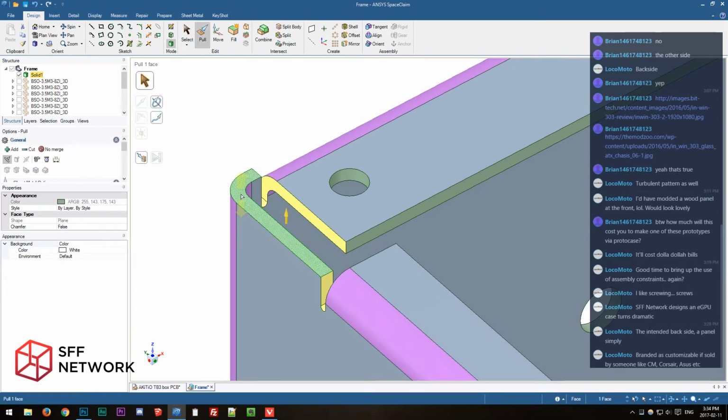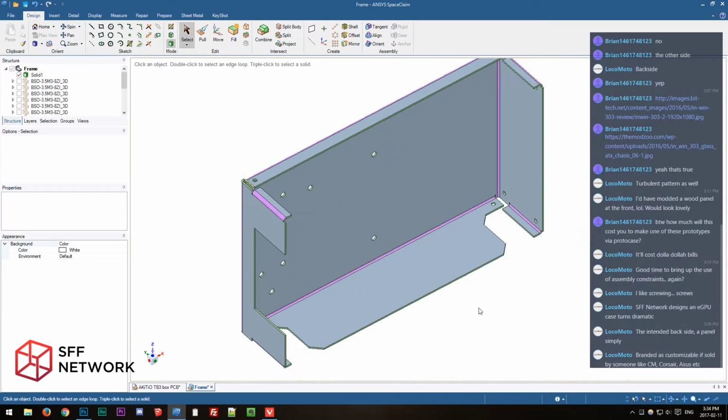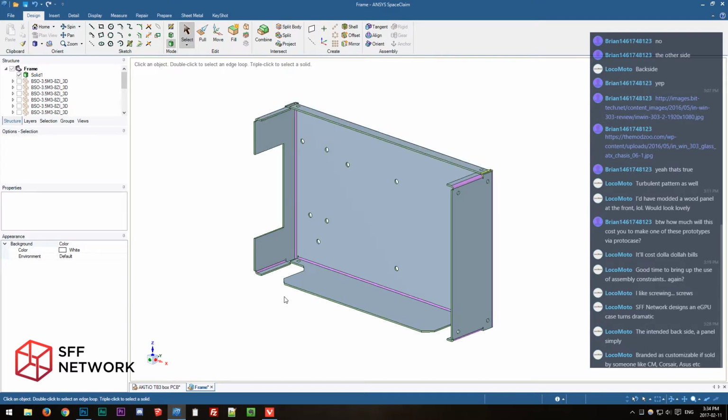And this is the thing, there's not any one answer. I mean, direct modeling has its disadvantages for sure for stuff like this. So if you mess something up, then you have to go in and fix it, usually in multiple places rather than just having one dimension in the original sketch or something like that you have to fix. But the advantage is that if you have a mess of a model, it's not a big deal, because you can just dive into any single point of it and make corrections instead of having to go through the whole feature tree.